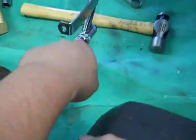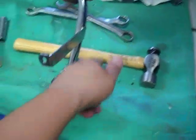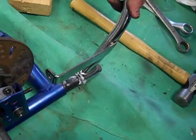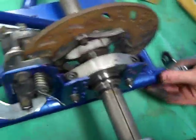We had to pull the bumper stops out - they get wedged in, so you've got to be fairly firm. Then you put them back to the bumper bar and knock them all the way into the hole. Here we go, like this - block of wood on the back of it because we don't have a brass mallet.